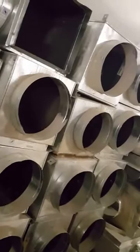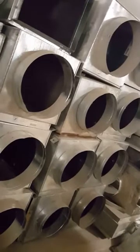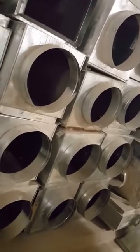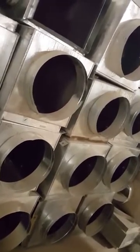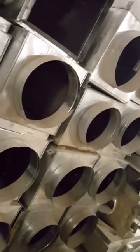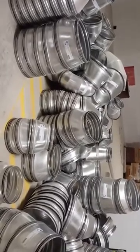This is a supply plenum box. When the duct branches go to flexible ducts, we install these plenum boxes and then put the grille on the down side. We make this plenum box with acoustic lining because the sound of the air needs to be reduced. You can see the cloth inside — that is the acoustic lining.